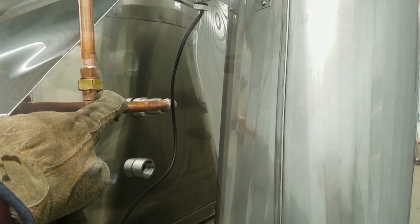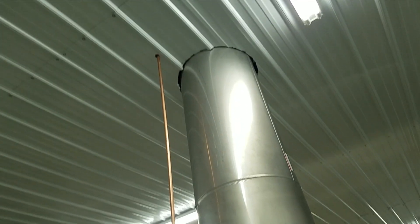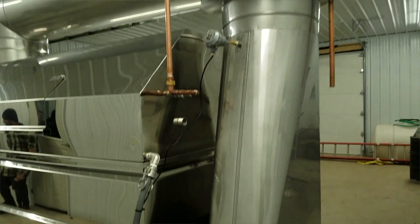Here's where I'm going to connect the vent. That's going to be a copper tube that I run up into the attic. I want it to be as high as possible so that no matter how much head pressure they have, it won't leak out of that vent.